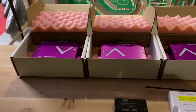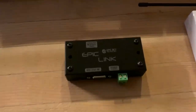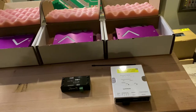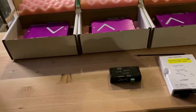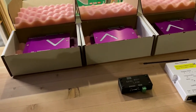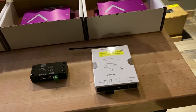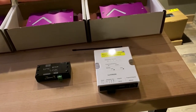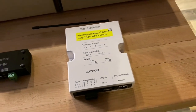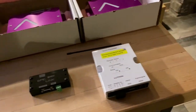Here's a quick overview of the control system for lighting. We have our advanced controllers, our Radio RA system, the Epic Link running the star ceiling, and an RTI XP8 processor controlling these off serial. Also not shown are the DIN rail modules that run the star ceiling and the pathway lighting — those will not be Lutron. The Lutron switches in the wall control the sconce lights and the soffit wall-washer lights using standard Lutron Radio RA dimmer switches. A Lutron Radio RA system runs a few hundred dollars and the Radio RA switches run $125 to $150 each.